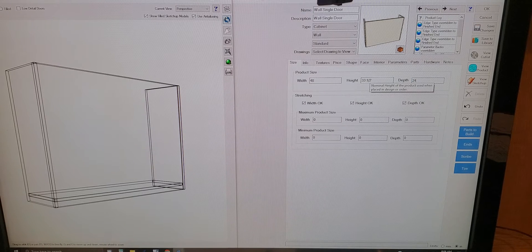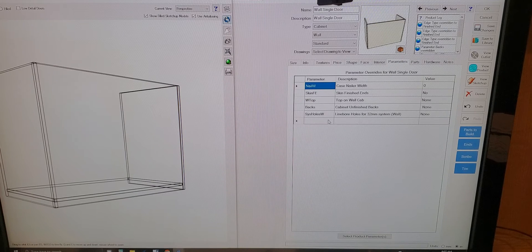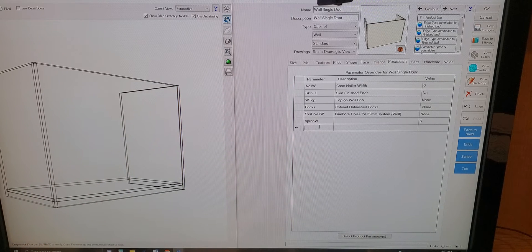24 inches is pretty typical for what I do for a wood liner cabinet. I'm going to take my existing unfinished ends — my left, right, and the front — and modify those in height, but I want to modify all three of them at once. So I'm going to add some parameters. I'm going to call this 'apron_W' for apron width and set that at six inches. I also want to set up a variable so I can tilt my sides in and tilt my front back, so I'll call this 'side_taper' and set it at five. I'll call this one 'front_taper' and set that at five as well, just so the math is easy to start out with.